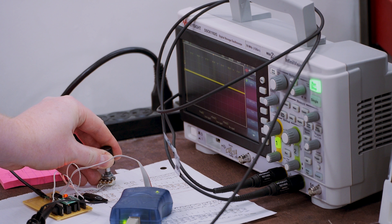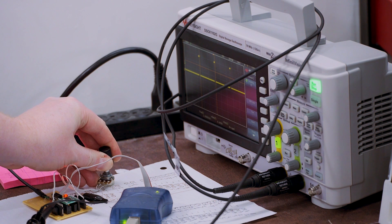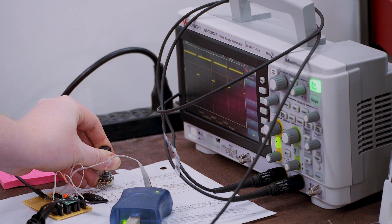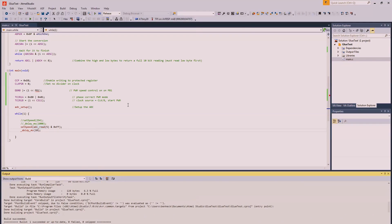Let's send this to the scope. Now we have a potentiometer controlling a PWM output signal. For motor control, the shorter pulses would be slower and the fuller the pulse is, the faster it would be. The reason I wanted the full 10-bit ADC is I want the temperature control to be fairly accurate - as in our previous episode where we were using the triac, we were looking for a range of about 10 degrees: if you're five below or five above it either turns it on or turns it off. I'm going to do all the code in Atmel Studio so we can develop it at a really low level, then we can have a hex file that's easy to program and make this device.